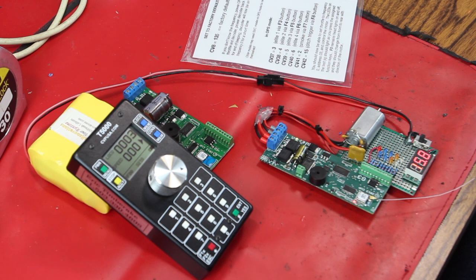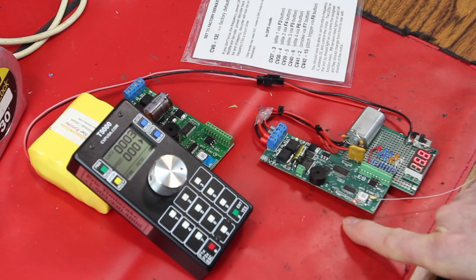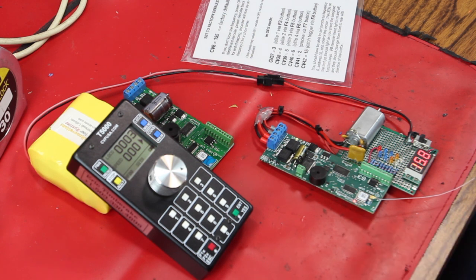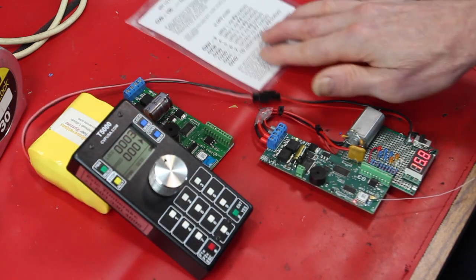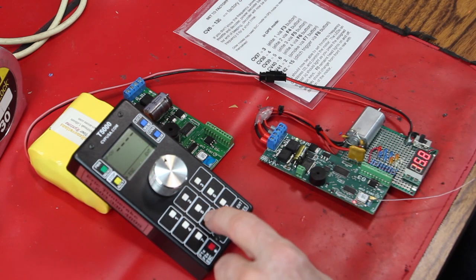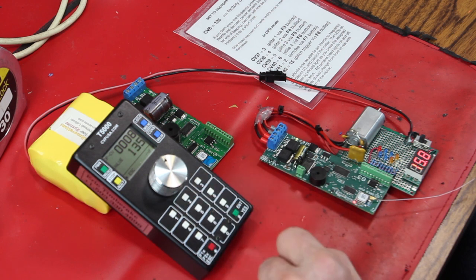In this case we can see immediately green light for power, that appears functional. We have the red light for carrier detect happening here. And let's see, we should be able to just make the motor move, that's all great. Let's do exactly the same procedure. We are going to ops mode CV8 to 135 to the factory defaults, beep.